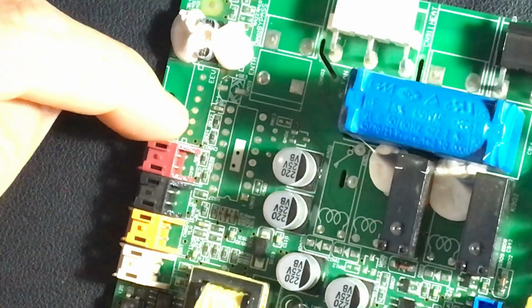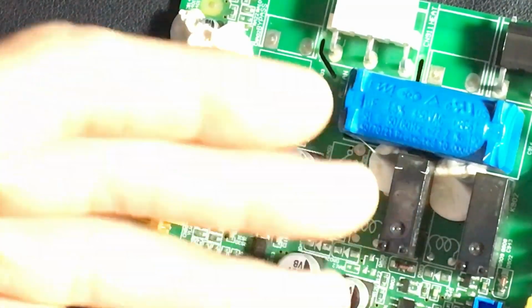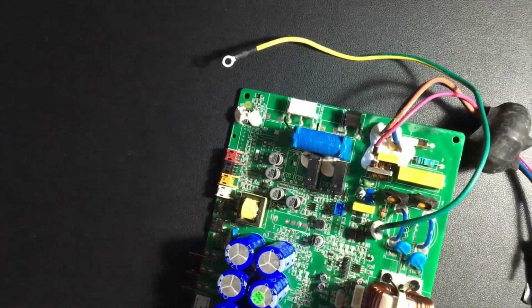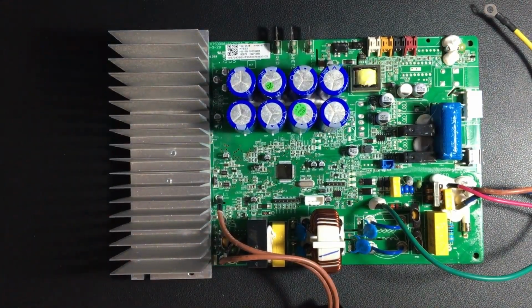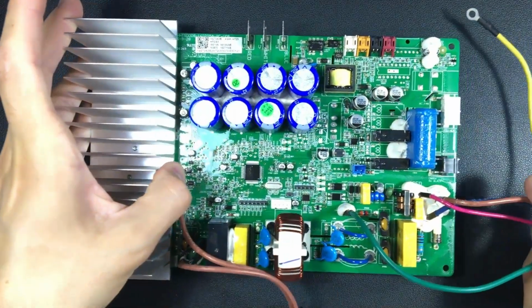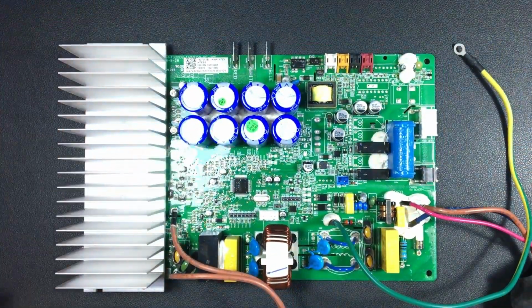We could measure the pulse emitted by the board with an oscilloscope in case it were the board that brings it, but well, this area does not usually fail. Most of the failures are in the valve itself. And one more detail to keep in mind that I mentioned, and then we will see. To be able to control an expansion valve correctly, you will need a universal board. With a universal board, we also have the possibility of testing electronic expansion valves.